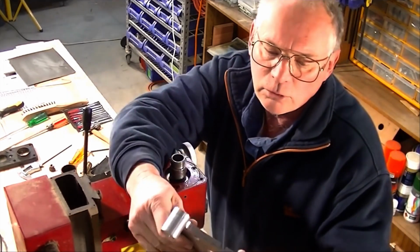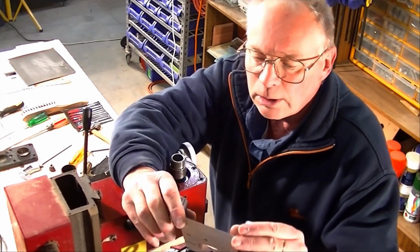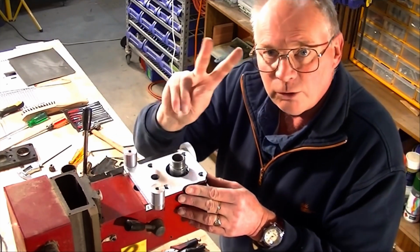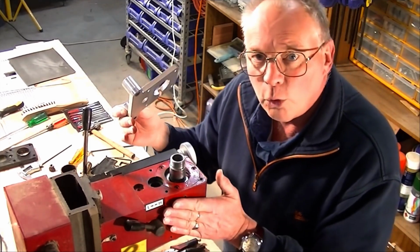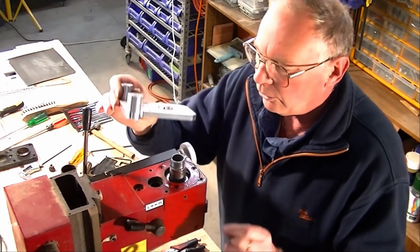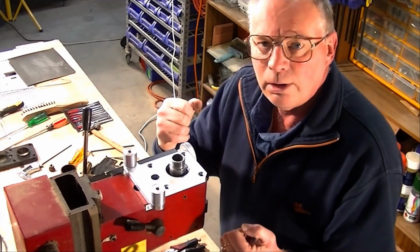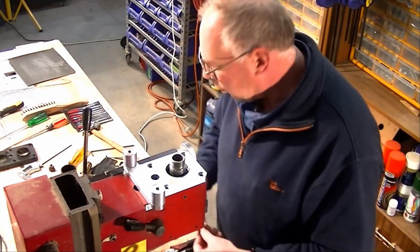And the second thing is I'm going to pre-drill this because I intend to manufacture and have available a tool changing air operated cylinder up here, or a manual type one with a lever. So there's going to be two types. I'm going to pre-drill this, so all you have to do is screw it onto this, not have to bore holes and thread them into this. The 12mm of aluminium plate, I think, is going to be very robust. It's only a little machine after all, and something like 25 kilo of pressure is going to be more than enough to keep an arbor in there. So okay, let's get on and get this in.